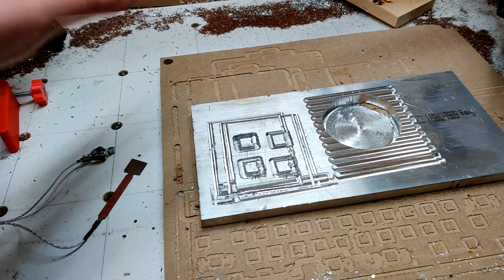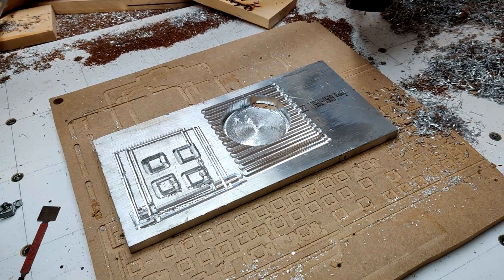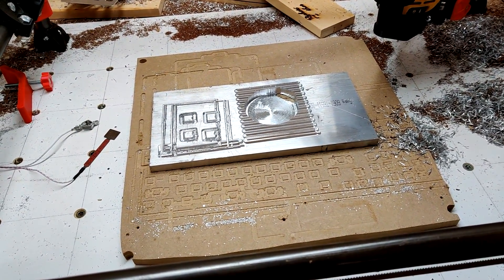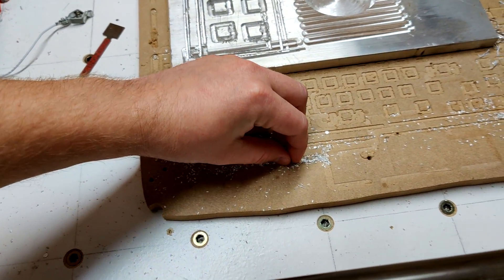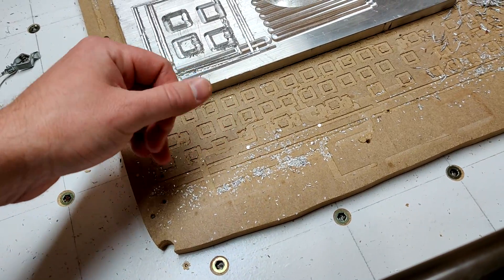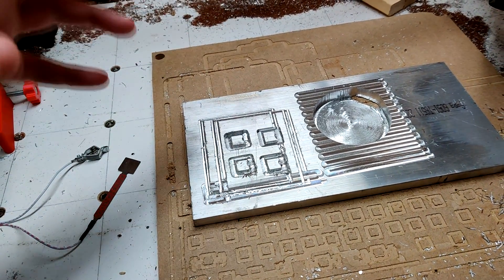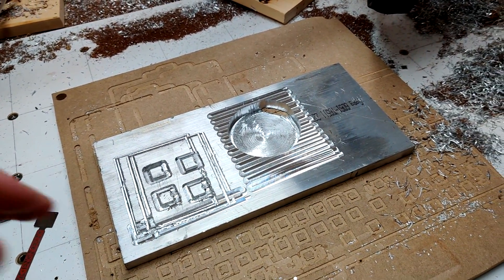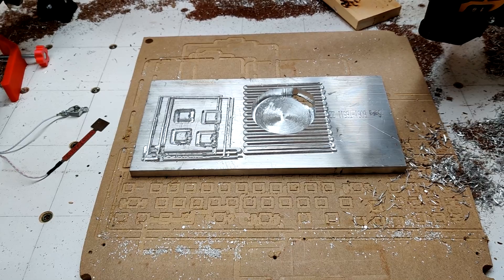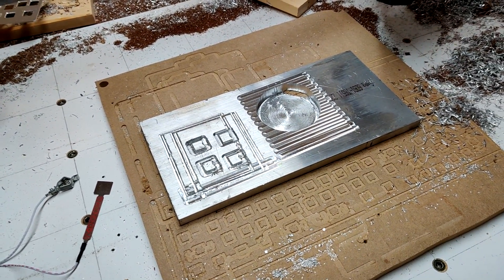This cutting here was just me experimenting. I'm cutting aluminum at 20 inches a minute — I normally cut walnut or wood at 30 inches a minute. There's an argument that slower isn't necessarily better. You've got to look at what kind of chips you're making. You can see these small fine chips here — still good. When I tried to slow it way down to like five inches a minute, I was not making good chips. It was chattering and vibrating. It might sound counterintuitive, but you've got to let the cutter do what it's supposed to. If you're going too slow, every revolution you're not making a good chip — you're kind of shooting yourself in the foot. You might want to try speeding it up.